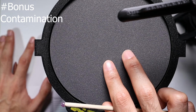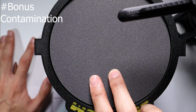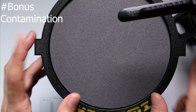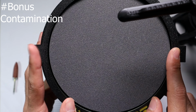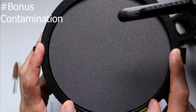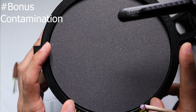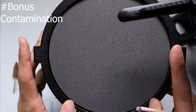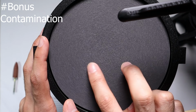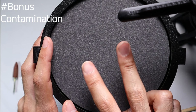Don't recycle your water and just put it in some kind of aquarium pump loop. You really want to separate your wastewater from your clean water, and you want to separate every single one of these pads. I can't stress that enough because it is super important. It's the same with your polishing powders, your cerium oxide versus aluminium oxide. I use both. I keep them completely separate. When I'm packaging them for sales, I do them on completely different days. I do full cleanings in between. I've got gloves on, everything. I try to keep all of that stuff as separate as possible because once you get a contamination, it might take you ages to find it, and by then you might have wasted hours. So the best thing to do is to just avoid it completely.